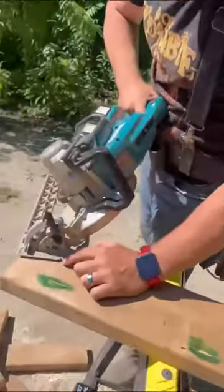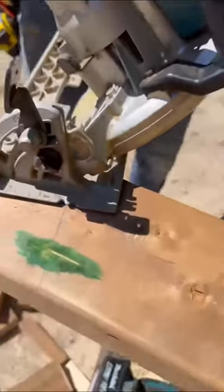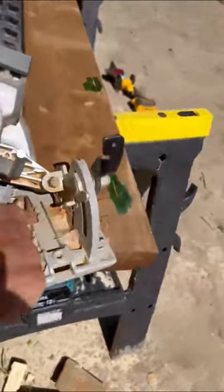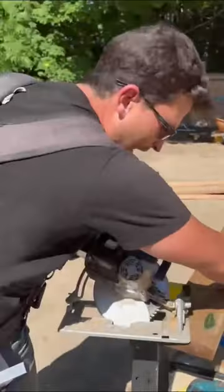What's cool about this? The cursor here at the 45 is what you're gonna follow because you know you're 45 degrees. But it's also cool about this saw — there's another cursor at the blade for the zero and the 45. So if you line cursor A and B up before you even begin your cut, you know you're going to cut straight down the line.